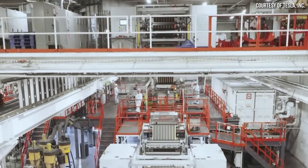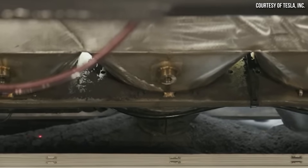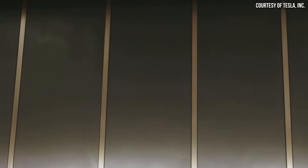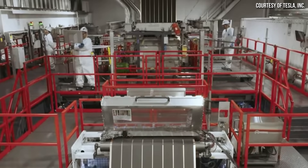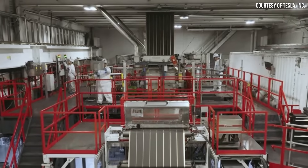The machines necessary for this wet process, especially ovens, take up a lot of space on the factory floor, and it takes extra time to do all these processes and to dry these electrodes. However, with Tesla's much improved dry battery electrode manufacturing process — an adapted technology from Maxwell Technologies, who they acquired — this dry process requires no solvents or drying ovens, and instead the active electrode powders are mixed with a binder and pressed directly onto the electrode foil.